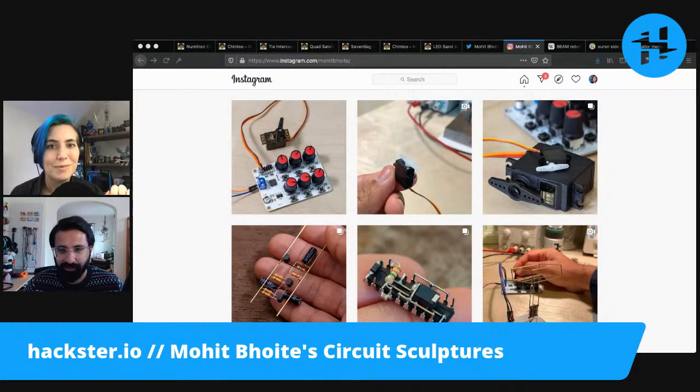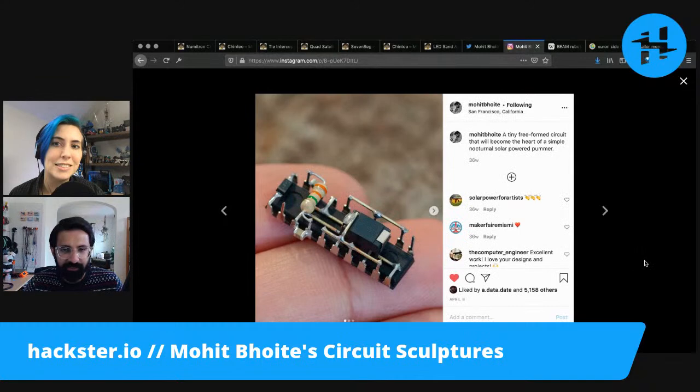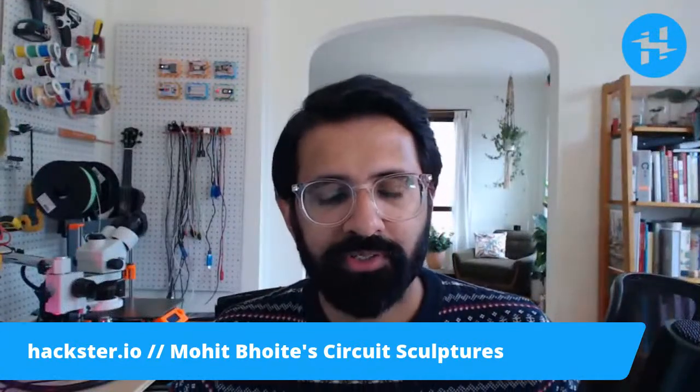He is like my personal hero and guru in terms of who introduced me to electronics as a kid, and the idea of freeforming it. So this is a good example of a dead bug where the IC is on its back, and this is a circuit that goes into one of those pummers. Basically, it's an RC oscillator using logic gates. But yeah, Mark Tilden and I think Peter Vogel, who was a German artist, he passed away, but he made beautiful, beautiful electronic music sculptures.